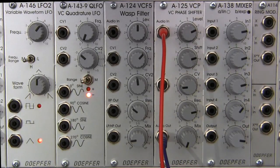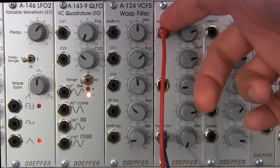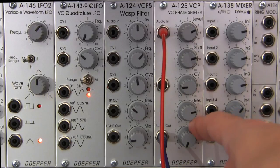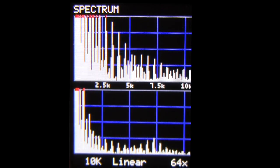So that's our basic demonstration. Now that we have that out of the way, we're going to take a brief pause before we go into the next segment. I think we covered the basics of the audio demonstration. Level is pretty straightforward — we're adjusting the level going in, so if I want less level, I bring it down. Shift is the one we've been playing with, allowing us to adjust the amount of phase shift. And then closer to the bottom, we have our resonance control, which changes the depth of the signal cancellation — what we're experiencing is an actual tone color change in our sound. We didn't really play around with mix too much, but I wanted you to have a basic idea of sonically what's going on to the signal.